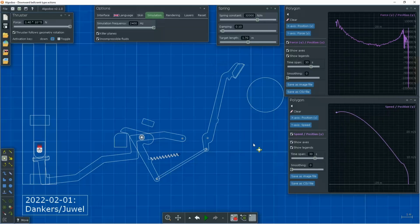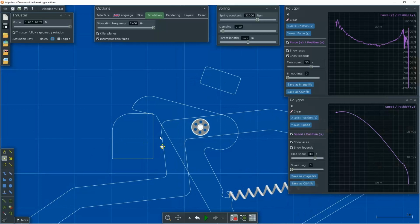So, again, basically, the x-axis is the y displacement of the key. So since it's decreasing, then we're actually starting from the right toward the left. And then the y-axis of this graph is the net force on our simulated finger here. So given that, we can see now this initial stuff here where it kind of like increases, I'd say that's probably more so due to limitations in the rigidity of Algodoo's simulation.